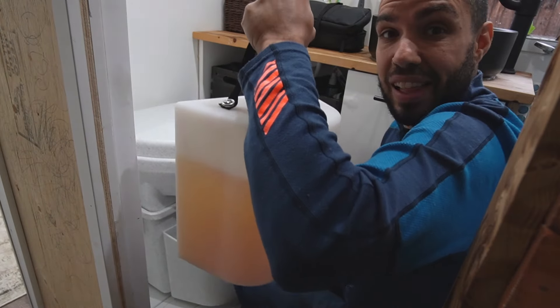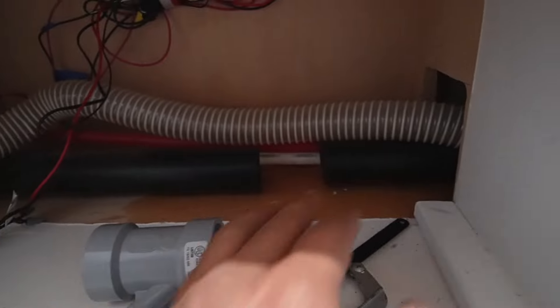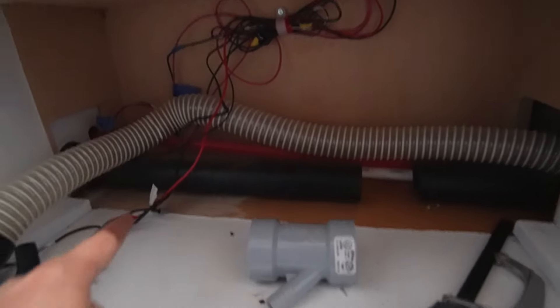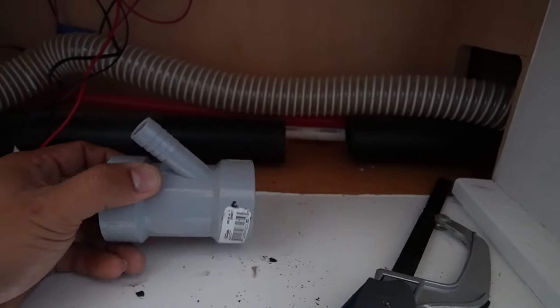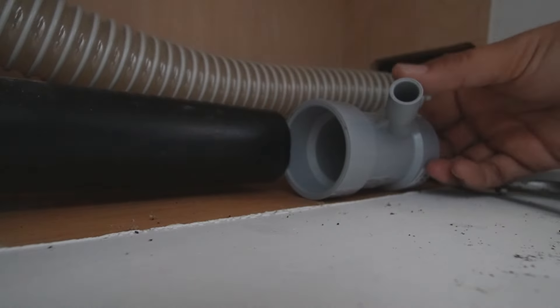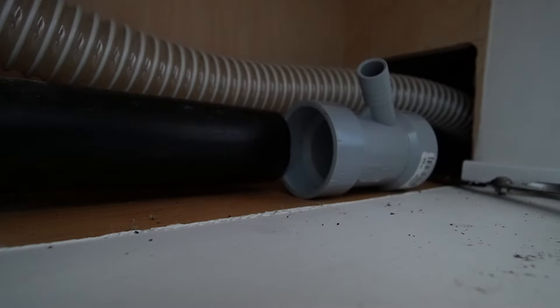Taking this out — that's all full of pee. So this goes up here; I'll put it all the way up and screw it in tight. Then our hose is going to go right in there and behind this panel. What I did was I very gently cut a section of our PVC drain pipe. This is where our kitchen sink drains down, and the other sink also drains over here and goes down into our tank. Now I'm going to install this piece so our urine goes into this tube and drains down into our tank as well. I want to make sure that this inlet is facing up, not down, so that any sink water doesn't drain into here. Thank you, gravity, for working with us.